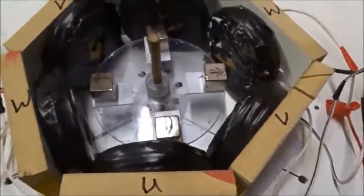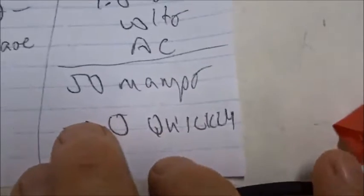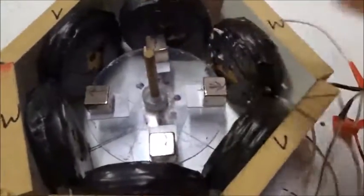If we take UV pairs, that pair or that pair across there, instead, hand spin it with 3-phase wiring, we get about twice the voltage AC and about 50 milliamps, and it goes down to 0 almost immediately as the rotor brakes very quickly. So clearly we're involving both of these 3 coils in the 3-phase arrangement.